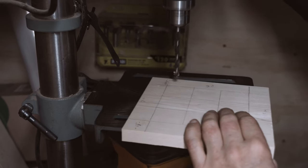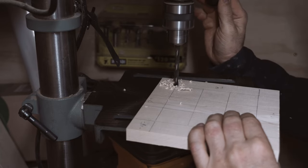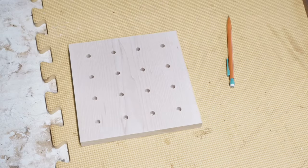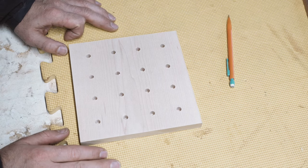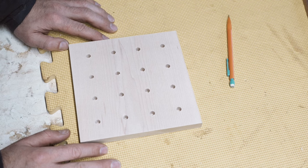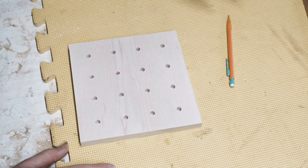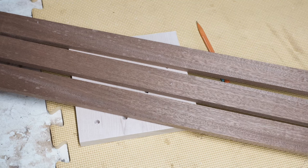Let's drill some holes. So there's the board sort of finished. I'm going to run it through the table saw and just cut the edges off — chamfer the edges on the table saw so they look a little bit nicer. Make sure when you're doing this, do all of your markings before you chamfer the edges, because that changes your overall measurements. Then we'll cut out the trim edges that go around that, cut a dado or groove into it so it wraps around the plywood, miter those in, glue the board in, and cut all the posts to size so the little beads sit on them.